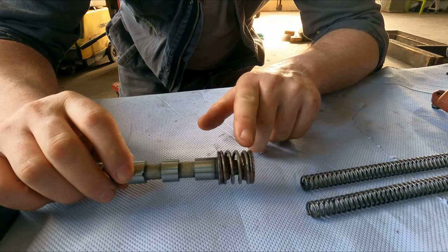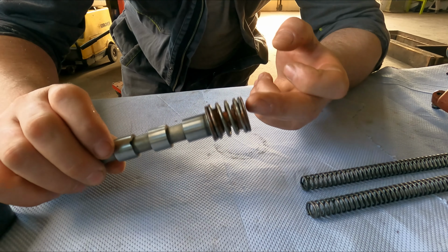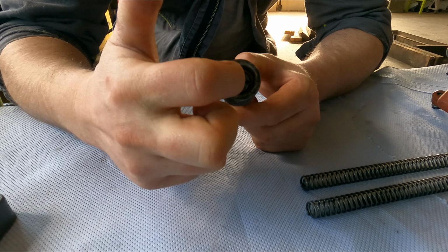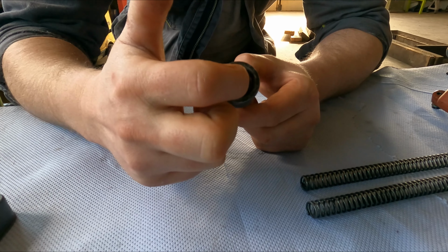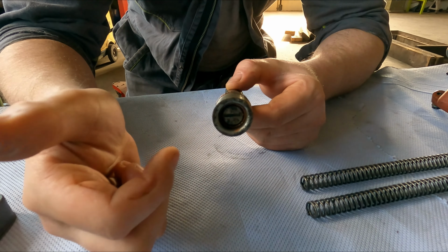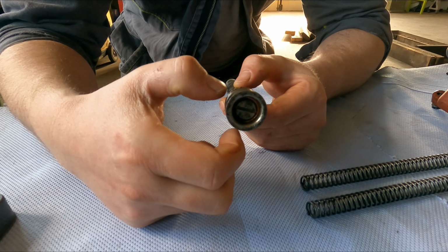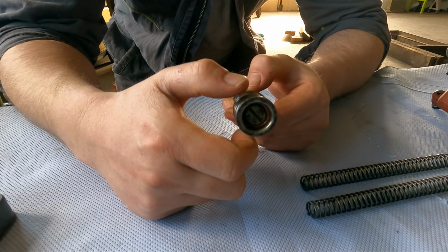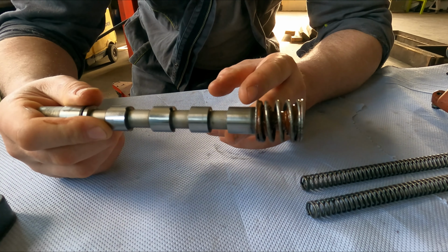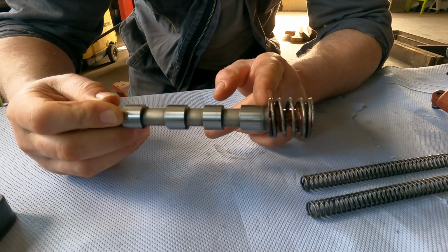If you have this problem, you don't have to buy a complete new valve body. Basically, unscrew the spring from the back side with the screw here. Remove the one cup. Remove the spring and the spacer, and then this seized cup here,